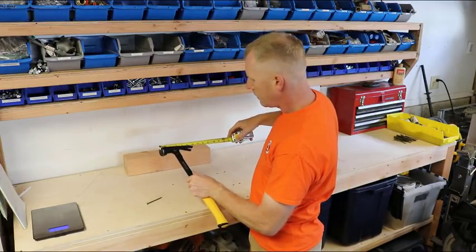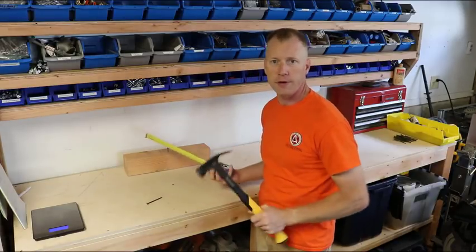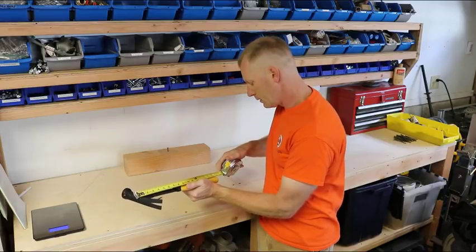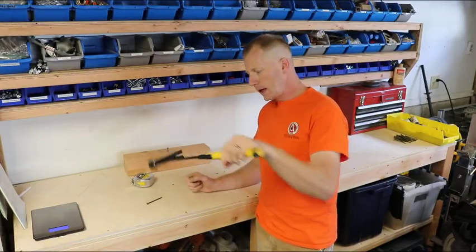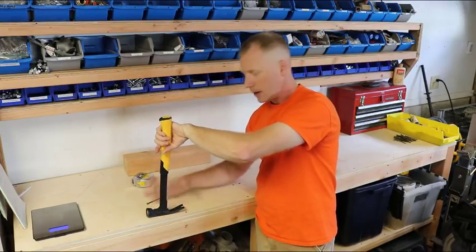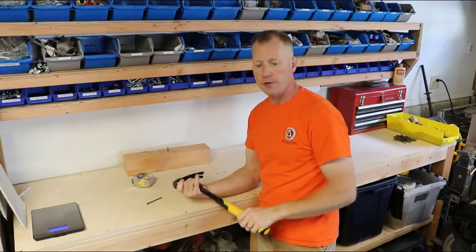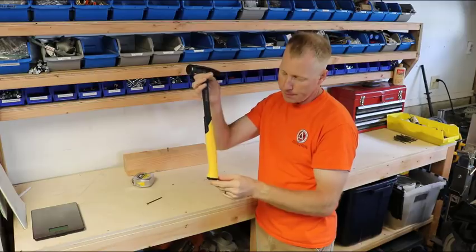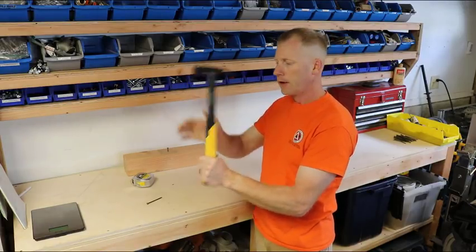The head itself is right around five and just a smidge over three-quarters of an inch — technically thirteen-sixteenths of an inch. The overall length on this one is about sixteen and a half inches, so you can use it to space your nail spacing. It's a little bit longer than the other hammers, so you might get a little more whip to it. It's a straight handle with a slight kick out on the end to help hold it in your hand while swinging.